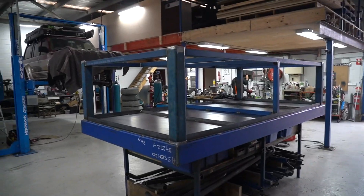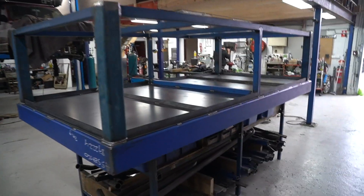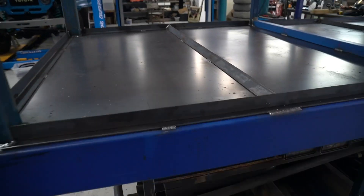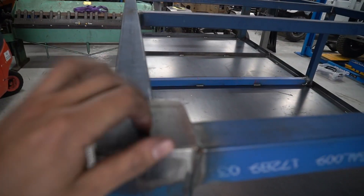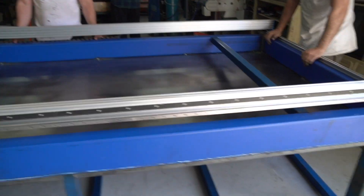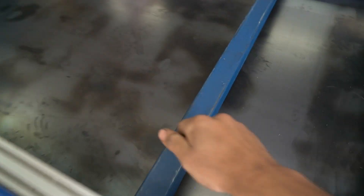We're ready to flip it. We'll do a weld off on the inside and then try and mount the plasma on top. Do you want to quickly run everyone through the design? We've just sort of braced the bottom so this plate doesn't warp — even though it is 6mm thick, we are putting a lot of heat into it. And then we've got shelving, so when we flip it upside down, we'll be able to put some stuff on these shelves. And we've capped and cleaned up all these ends off as well. So the machine on the table now lines up perfectly on the inside, which means we built it correctly and got all the dimensioning right.